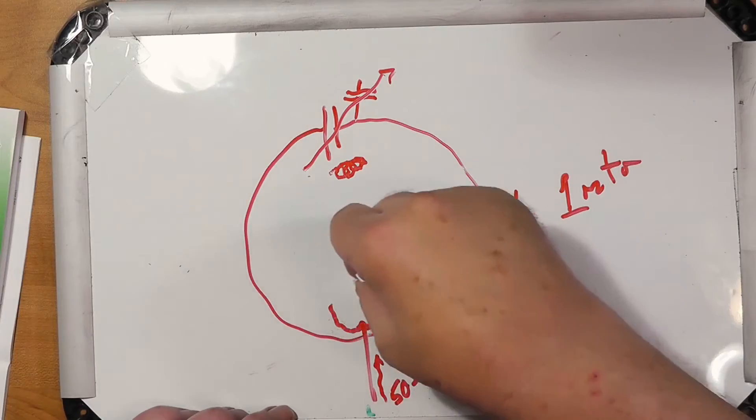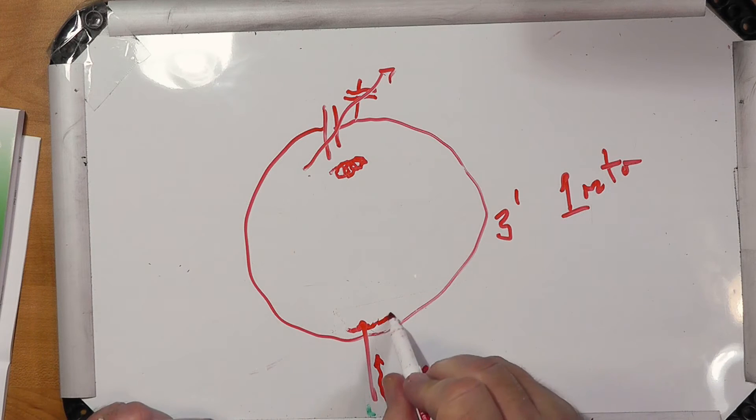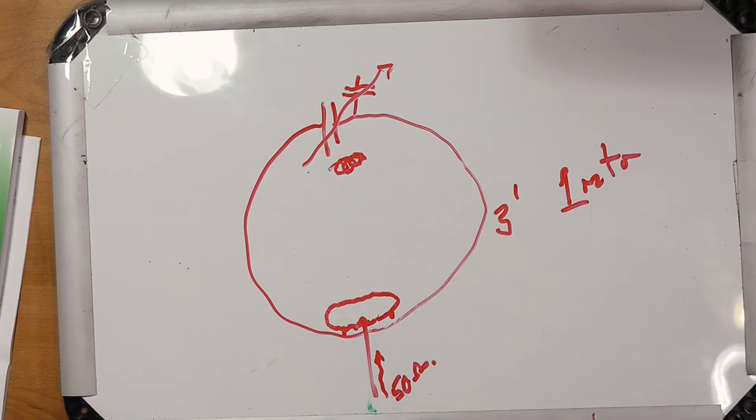Alex Loop has a really nifty little loop tuner aid, but only if you're in a place where you can see it — it tells you where you're tuned. So the question is about the shape of that inner loop. Most people assume a circle, but the MFJ website suggests you squash it a bit and get it a little closer to the main loop. That does help — I've tried it, it does help. Anything you do is going to affect the Q of the circuit, the bandwidth, which is the great compromise here. But otherwise you're going to get a signal that's just as good as a dipole.